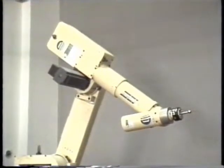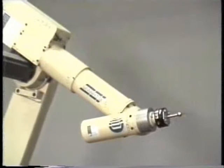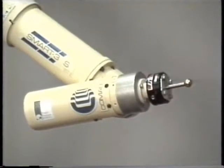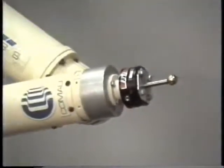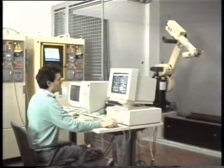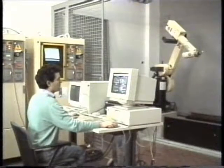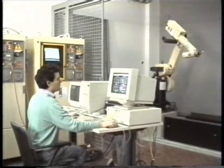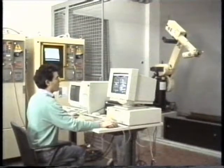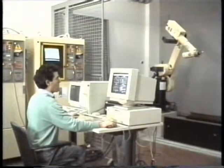In order to perform experiments of force motion control on the single robot as well as on the dual robot system, an ATI-130-10 force torque sensor is mounted at the tip of each robot manipulator via a suitable tool adapter. A steel bar with a terminal sphere is used as the end effector. In the following experiments, different force motion control strategies are tested for the first three joints of the manipulator on the left. Trajectory generation and control algorithms are implemented on the PC at one millisecond sampling time, and the reference motor currents are input to the joint drive systems.